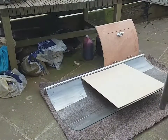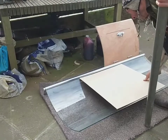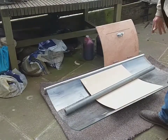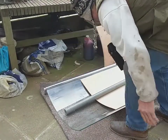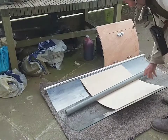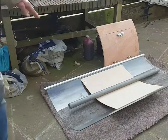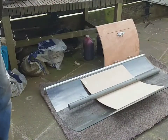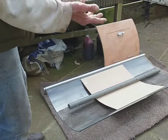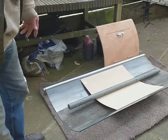This is how I've made the curved boot. This is a piece of 3.6 ply. What I've done is two layers at a time — rolled glue on it. This is an old glass shower curtain, packed across with a couple of clamps so I don't break it. I've rolled glue on and added another layer, then put loads of scaffold poles across, then bags of sand and cement on top to hold it down. When it's dry I took off the poles and rolled another layer of glue and another sheet, until I eventually got four layers.